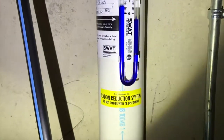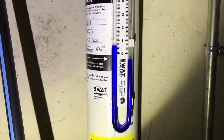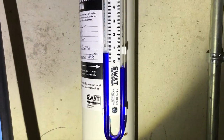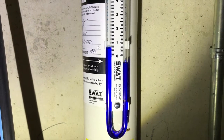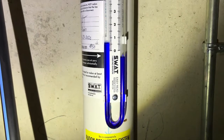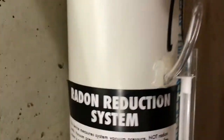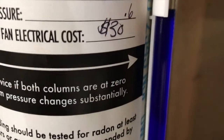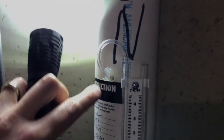Continuing up, you have a pressure gauge, and they put a sticker here: 'Radon reduction system — do not tamper with or disconnect.' You will notice one side is higher than the other — the left is higher, the right is lower, and that is exactly how it should always look. That is a clear indication that your fan is working and sucking the air up, and your pressure gauge is showing the pressure differences inside the system due to the fan. One additional thing — estimated annual fan cost: $30. Not bad at all. They tapped the pressure gauge into the plumbing just by drilling a hole.